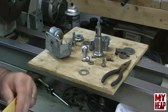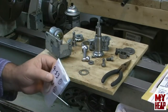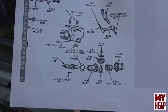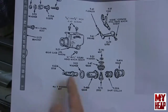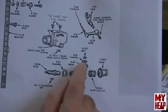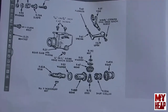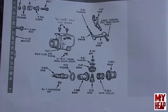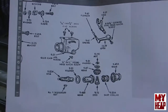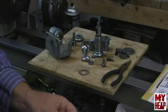A couple of things I want to mention though: even though the things were two or three dollars a piece, when I called them up they said the one washer — the one that goes toward the headstock spindle that holds the lead screw gear, 9-53 — they had in stock. When I asked about 9-51, they told me that has been replaced by two 9-51As. Just so you know, in case you're curious and you have the same parts diagrams from the Atlas Craftsman Group or VintageMachinery.org — 9-51 has been replaced with two 9-51As.